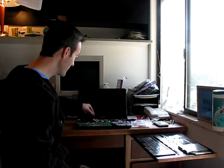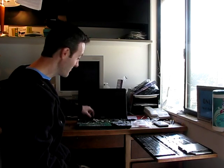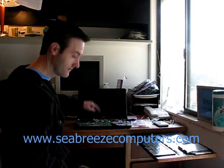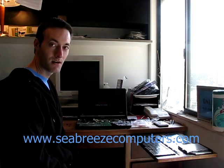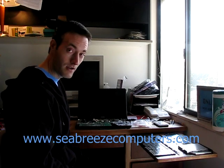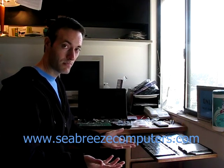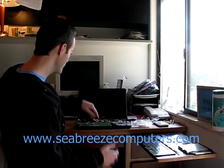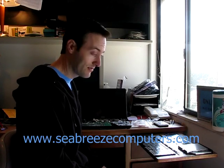I'm going to turn the laptop on — the left button on the little circuit board is the power button. It's powering up! We've got another light on the motherboard and we see 'Toshiba' on the screen. It worked! Now we have to put the laptop back together. You can find disassembly instructions online and just reverse them. Make sure you turn it off and unplug the power adapter before reassembling.